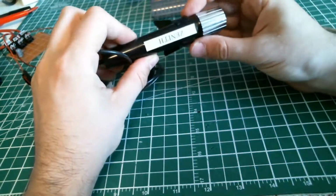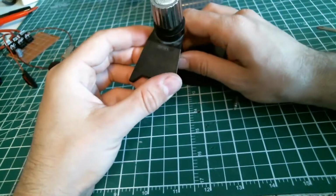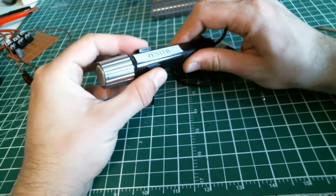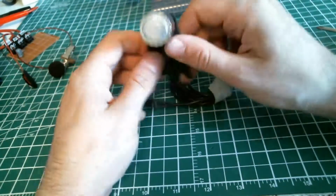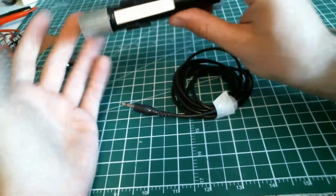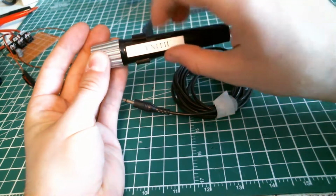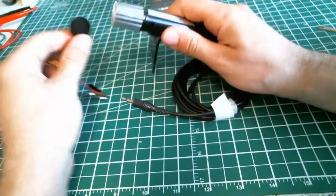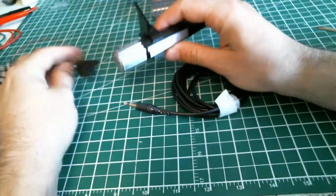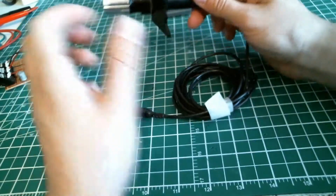And here we have something pretty special. These are some really old recording machine dynamic microphones. Their quality was kind of bad, so you can take this cute little microphone, put your AA battery inside the casing and repurpose the casing so it fits your electret capsule and make it fit into this little microphone nice and done.